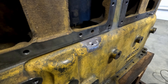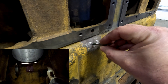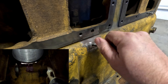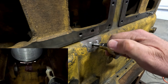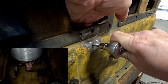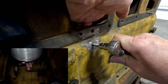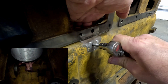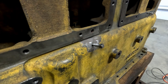We're going to degrease the pins that we're going to put in here too, put a little bit of green Loctite on there, and screw them in. I got a 3/8 12-point that'll fit on that pin just perfect. I want to feel to make sure I get through the inside. They said right about where it snugs — I don't want to go too much because I don't want to spread that crack. I'll call that good.